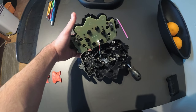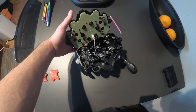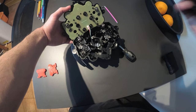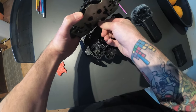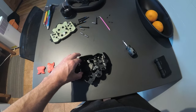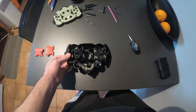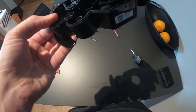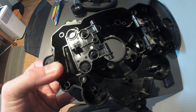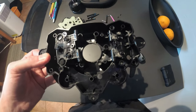There it is on the inside. You can see that one cable attached to the PCB — a very beautiful PCB, by the way. We're going to disconnect that; I just found it easier to work around with it disconnected and it's pretty easy to do. With this part, you can see what one of these looks like — they're attached to the paddles in the front. The metal paddle is actually attached to a plastic piece on the inside. There are two screws attaching it on, and that's where the springs sit. They push back on the paddles to return them to their neutral position. You can see this one over here where I've Bondo'd it. I'll get them apart and show you where the fail point is.